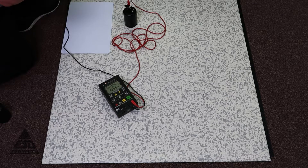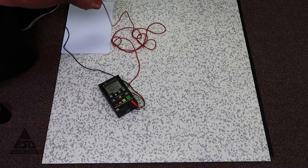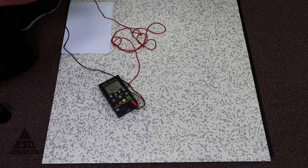This should be done in a humidity controlled environment at 12% and 23 degrees C. We're going to use the 2.27 kilogram probes with the 63 millimeter diameter of conductive rubber. And before we make our first measurement we want to make sure that we can actually test greater than what we're going to do.